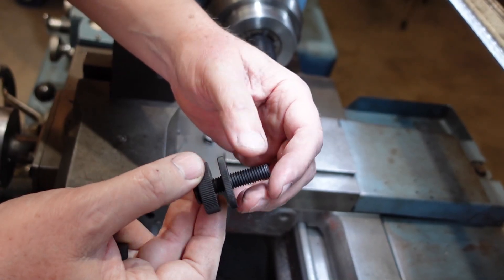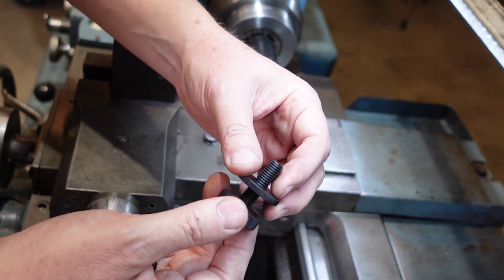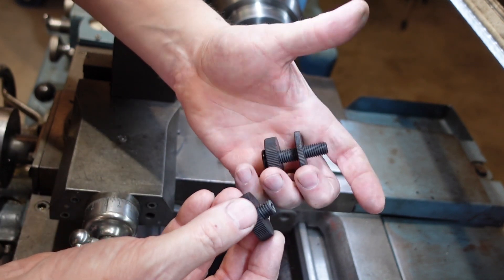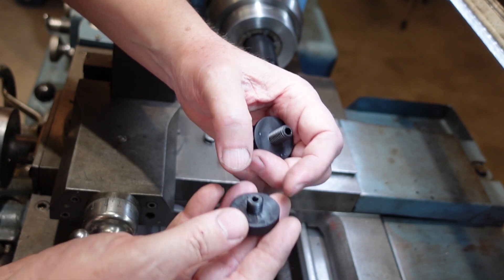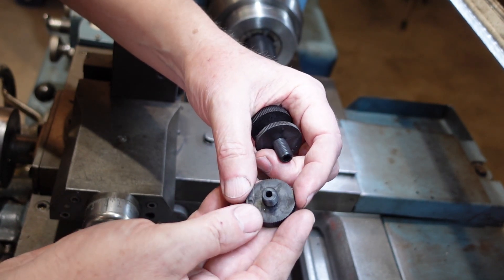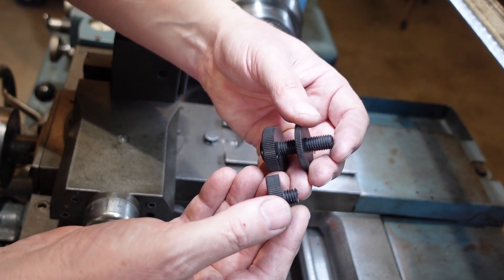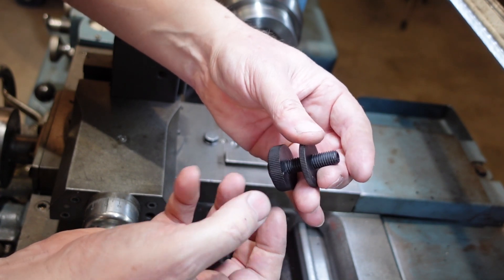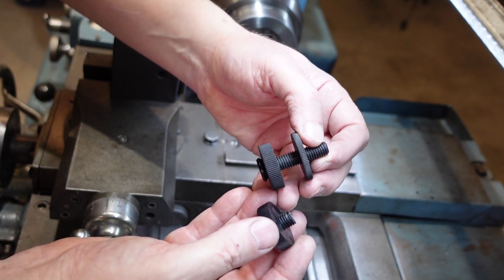This is the subject of today's video — an adjustable foot from a projector. It consists of a lock nut, an adjustable screw, and down here a stop which has a swivel on it. One of the pair broke and I was asked if I could make another one. The problem with saying it's made of plastic is there's a whole bunch of things that plastic is and isn't. This looks like glass-reinforced nylon, and I can't get those properties from a machinable grade, so I'm using POM instead. The term 'plastic' is as broad as saying 'can you make this out of metal.'